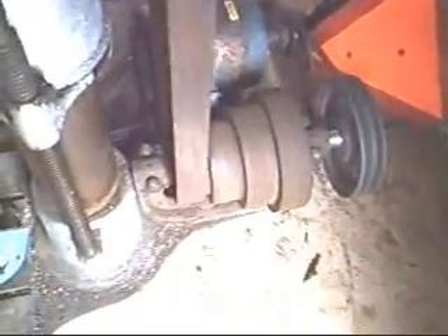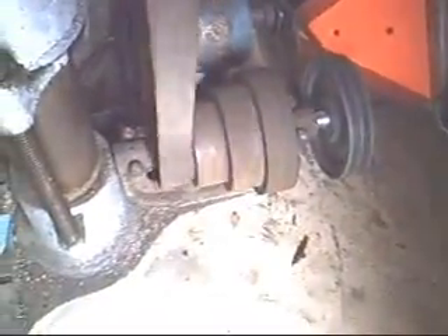I'm going to add some grease fittings. This is Babbitt up here on the nose bearings, and this here is just a steel shaft running in another steel shaft. It needs a grease fitting, and that's Babbitt down there — they're already drilled for oilers. Anyway, there we are. There you go!